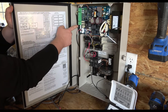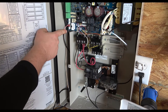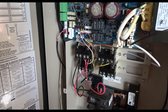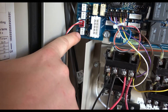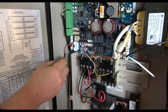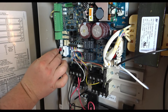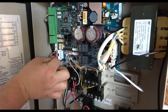This is the area where the valve actuators tie into the circuit board. We've got four slots: VLV one, two, three, and four. These are pre-labeled from the factory — VLV one for return, VLV two for suction — just as a quick reference. You can plug them into any port and then program them via the Omni, but normally we plug the return side into VLV one and the spa side into VLV two.